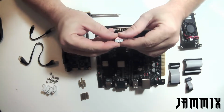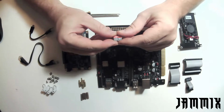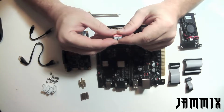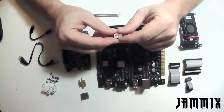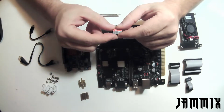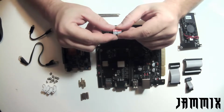Before we get started, the first thing is you'll want to have a properly formatted MiSTer SD card. You can use either of the MiSTer installers to build your SD card. I'll leave links to those in the description. I'd probably recommend the Windows one for Jammix just because it formats the card and puts all the files on it. There are two files that do need to be configured, and those configurations are listed in the description of this video. Those files are the u-boot.txt that's found in the Linux directory, and also the MiSTer.ini file.